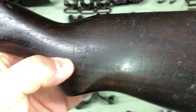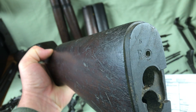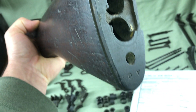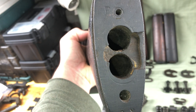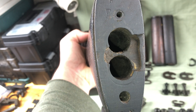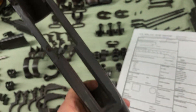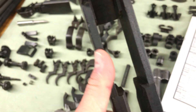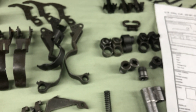There's a small ordnance wheel at the bottom of the pistol grip. This one has a rebuild mark - SA with a T on it. Some Springfield Armory stocks had marks under the butt plate. Are there marks? What's the size of the holes here? Is it routed out for a trapdoor butt plate style? Annotate all these things. Check for pins up here and cracks.